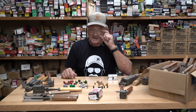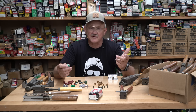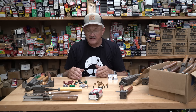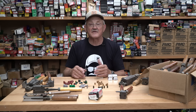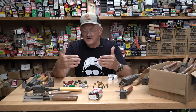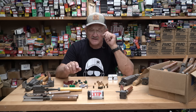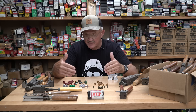Back in the day we just shot raw lead with a wax lubricant. Now you have all these different colors and coatings you can put on bullets. A friend of mine casts and uses powder coat — those are his powder-coated 45-70 bullets. The Hi-Tech coating acts as a lubricant, seals the bore, and puts less lead in the atmosphere, so your bore runs cleaner. If you don't need the precision of a true jacketed bullet and regulations won't allow jacketed, this is another great choice.